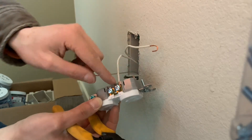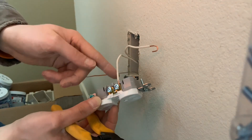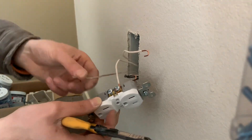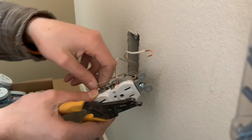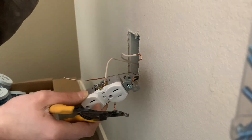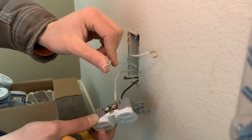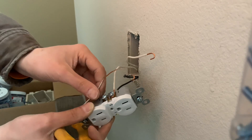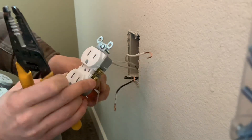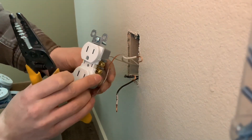Because I stripped about an inch, there's not really much copper exposed out the back. Sometimes a little does stick out, but I don't think it's a big deal unless your ground wire floats up and touches the other wires. Just make sure once you shove it in the wall, the ground isn't touching the silver screws or — even worse — the gold screws.